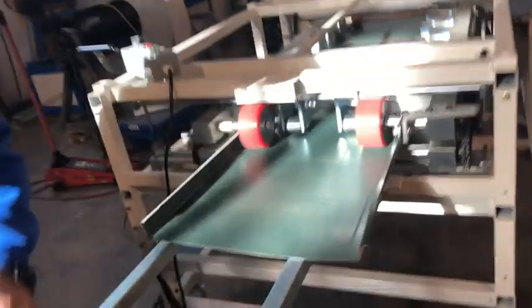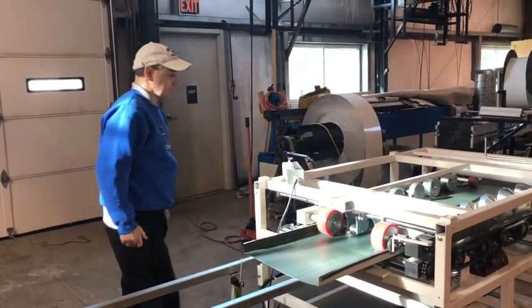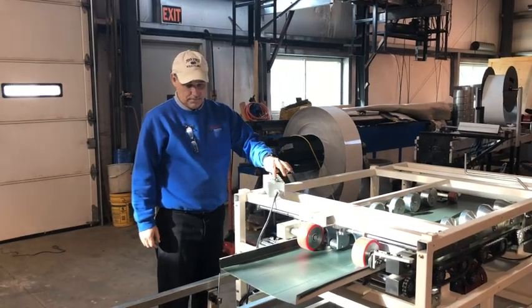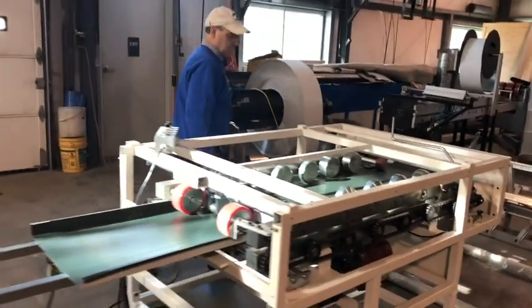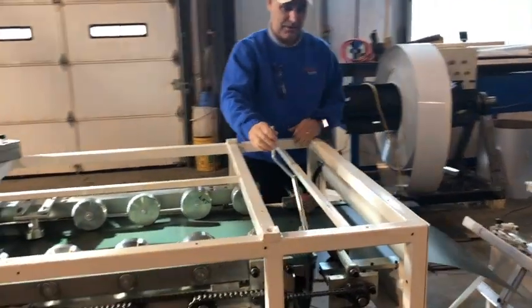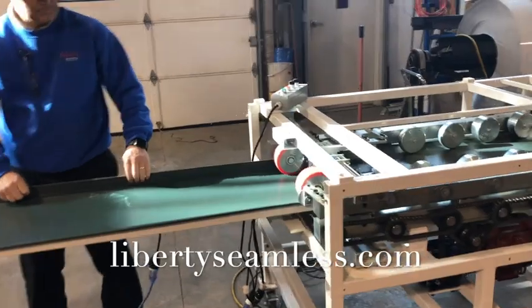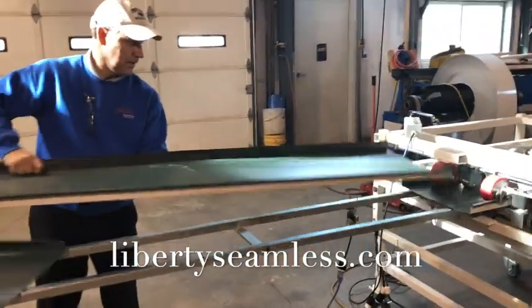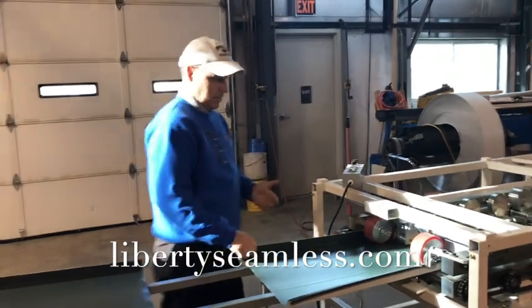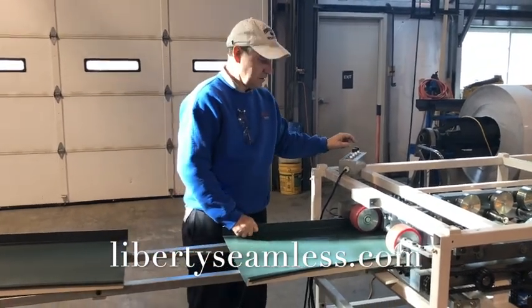You can see how automatic works. I'll move this limit switch here — it's on a magnet — and I'm going to turn this to automatic and hit start. It stops. Now I'm going to shear this off. When I go back it will feed that piece out and start my next piece in. It stops the next piece — that's how this runs. And I can feed this out now if I want by going to jog and feeding that out.